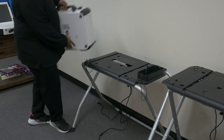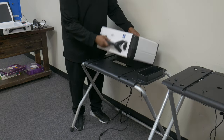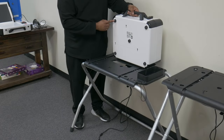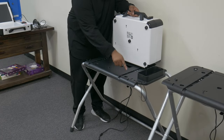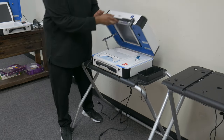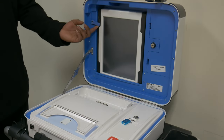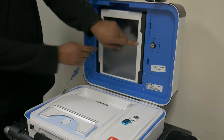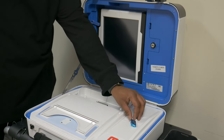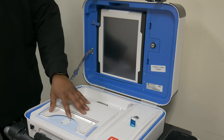This device is known as a duo. Duos are utilized by the voter to make their selections and print their ballots. Each duo will be positioned on top of a voting booth. First, make sure the voting booth's locking pin is in the unlocked position. Place the duo on top of the booth, making sure the five rubber feet seat completely inside the booth. Lock the duo in place by pushing the locking pin towards the rear. Open the lid — on the underside is the duo tablet, secured by a blue lever and a lock. Next to the lock is the Verity cable compartment. Below is the sealed V-Drive compartment. In contrast to the controller, the duos do not arrive with anything inside the V-Drive compartment. To the left is the tablet dock, and below the dock is the ballot printer.